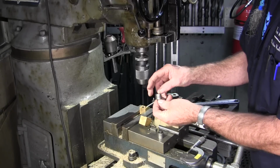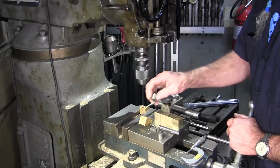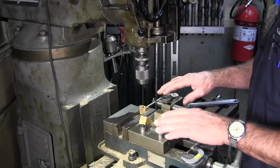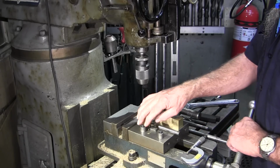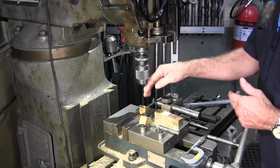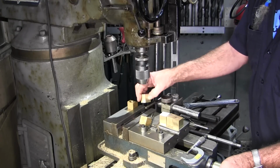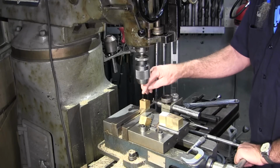Now, these blocks here are actually screwed to this, and you can slide up and down these blocks to become in line with the lead screw in place. That's how you compensate for the hand scraping in the ways area riding in relationship to the mounting of the slide itself. So we've got a good eye, and we trust it, and that's how we're going to put that in that location. We've marked all of our blocks in that position.